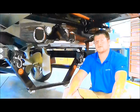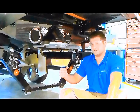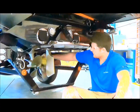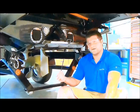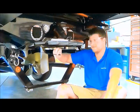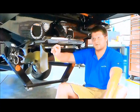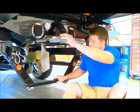One item I always check for ahead of time is to make sure that the prop shaft is not bound in the shaft log or on the strut. Simply accomplished by just spinning the propeller and making sure that it's free to move. In order to check the shaft log, you can use a medium-sized zip tie, insert it around the shaft, and move it around the actual shaft to make sure it has enough clearance on both sides to get through.